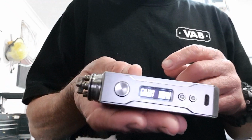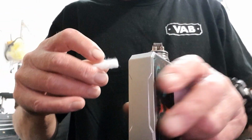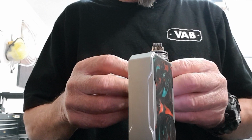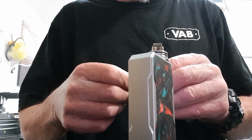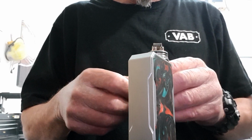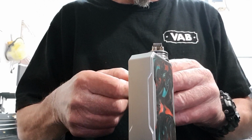And there you go, 0.15. So that's where I was aiming, around there, 0.14, 0.15. Because you've hardened everything, brought everything up to speed, the wire will settle. It'll most probably settle a little bit more when it cools as well.